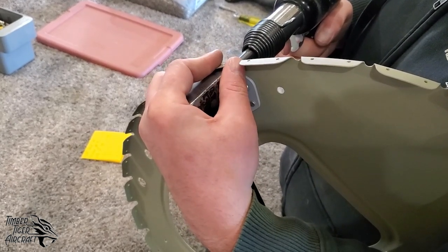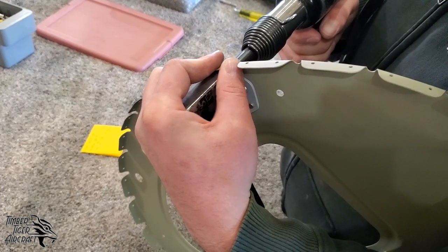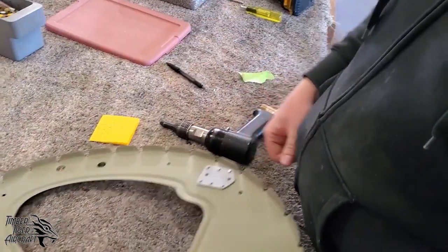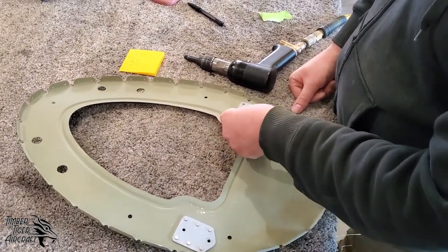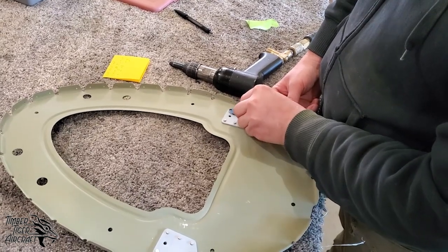All right. Pinch it nice and tight so nothing slides around. There's that sound change. And there are our rivets. And we will check it with our go-no-go gauge here. This gauge shows us where things would ideally be as far as diameter and height.